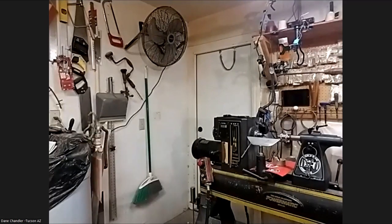I could help you with that. On the end of the skew, grind the end of the skew square off to the shape you want, and then turn the bevels, and then grind the bevels to the square end, sharpen to the square end that you left. You know what I mean? So that curve doesn't have to be any specific curve radius. No, it's like everything else, whatever you like. Get used to it. If you grind the top of that thing to the shape you want, and then grind the sides to that, sharpen to whatever you've got left, you'll come out with the right curve.